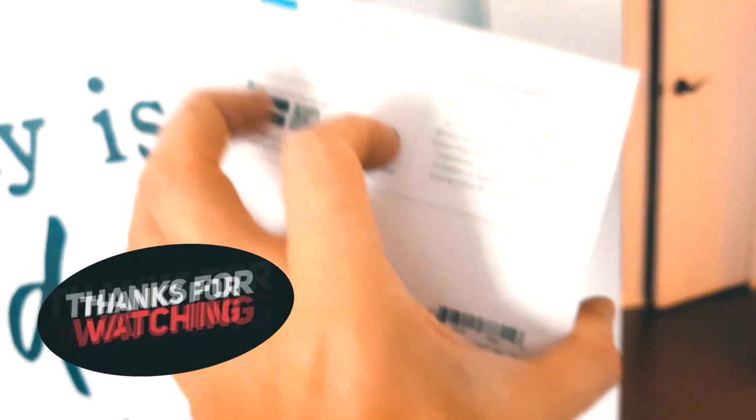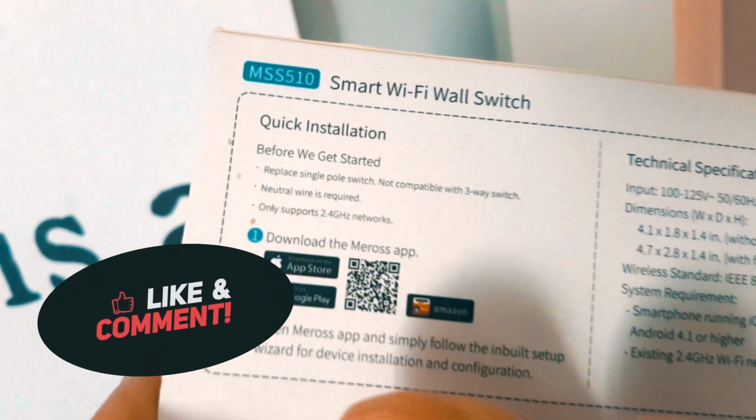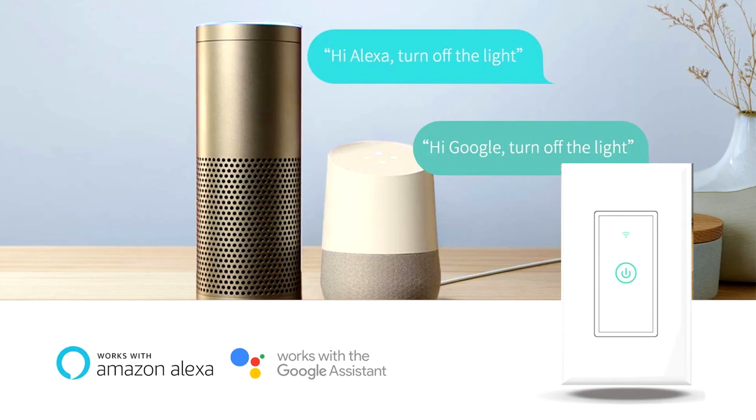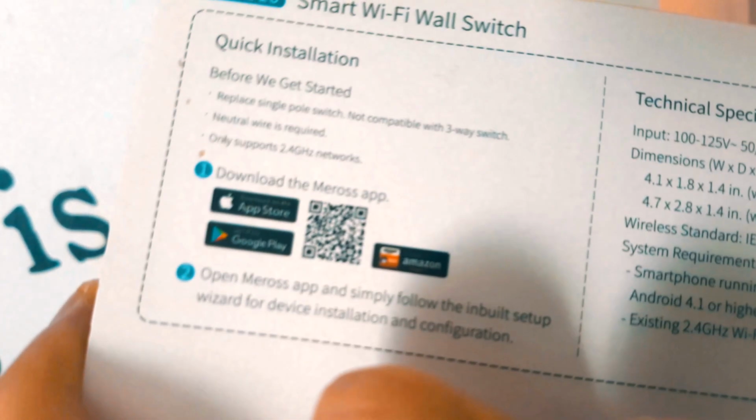So, quick installation, you're going to need to replace the single pole switch. It's not compatible with a three-way switch, only supports 2.4 gigahertz networks, Google, Apple. This also works with IFTTT, if this then that.